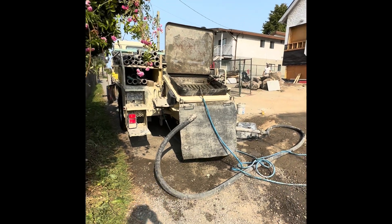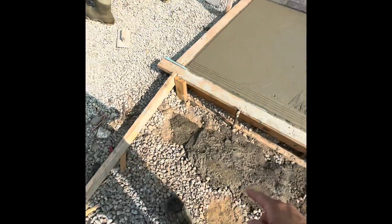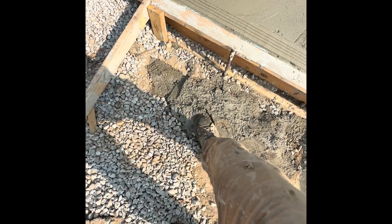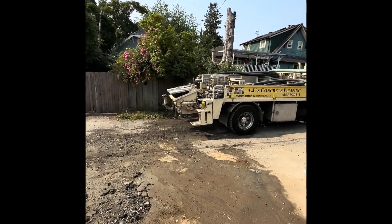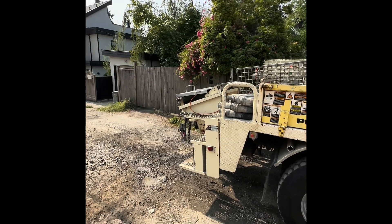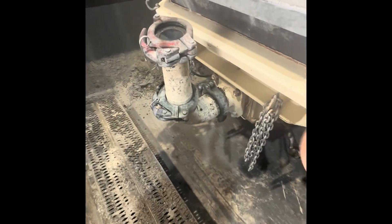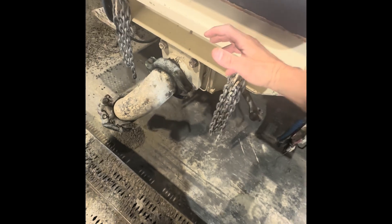Let me know how it goes. Alright, here we go - gonna go wash out now. Hot mud in the pump. This has been on the ground for 25 minutes, she's cooking. We'll check in on this hopper - I have about half an hour to go wash out and we'll see how this stuff looks by the time we get there. Sugared up - I bet it'll still be absolute piss. Wash out time. I always crank this elbow down. I always take a couple of strokes in forward before I wash out, before I dump my hopper. That way if I have any segregation or anything on the S-tube, I can push it out.